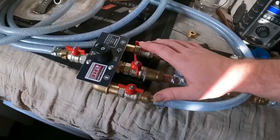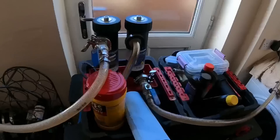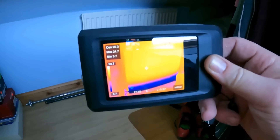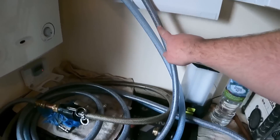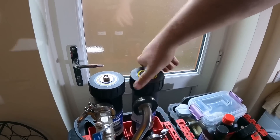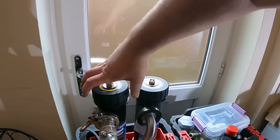Because it's not a combi, not a sealed system, we've got to basically make it a sealed system. We shut that half-inch lever valve onto the heating feed, then cracked open the thorough flush — and you can hear everything now shifting through the system. The whole thorough flush kit is flushing cold water through this rad. We've shifted to the rads downstairs and you can see how black this hose is — that's what's coming out through the dump side of the thorough flush.